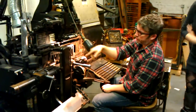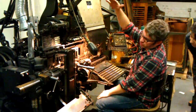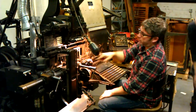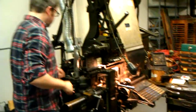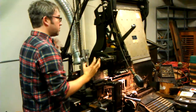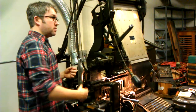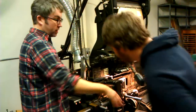I can actually open this up after I cast them on. The second elevator is going to drop it down in front of those mouthpiece and molds. There's a plunger right here at the top, and it's going to lock up. You'll see it squirts the lead into those molds. And then the wheel revolves, cuts it, trims it, and ejects it.